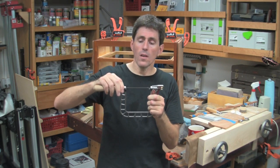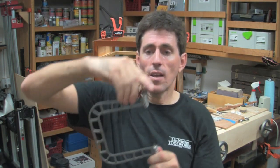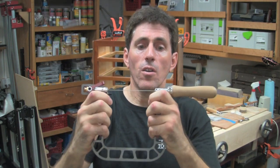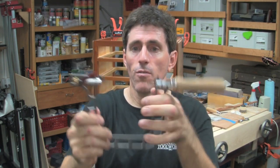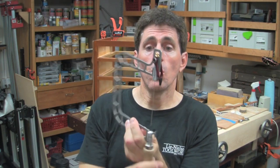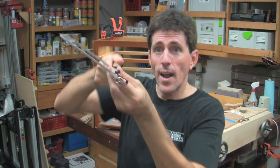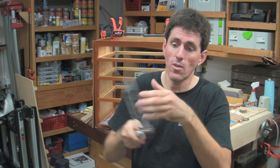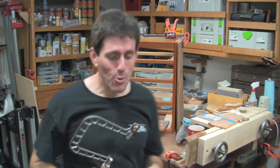The woodworker models are all the five-inch throat size. The difference is that the jeweler's saws have blade holders that don't rotate — the blade is always fixed out in front. For the woodworker model, if you de-tension the blade, you can rotate it, and there are positive stops at 90 and 45 degrees. This means you can actually cut across at 45 degrees, so if you're doing dovetails on a really wide hope chest, you can clean them out no matter how long it is, even with only a five-inch throat.